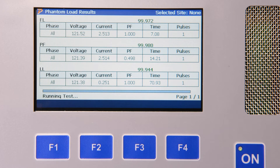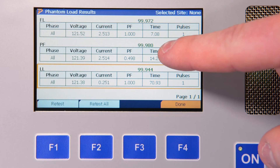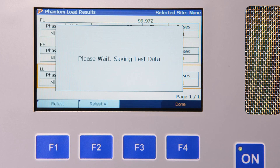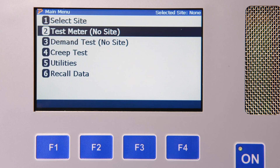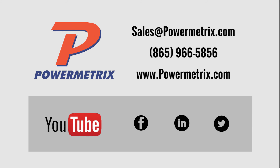You can see that for this test, the meter was well within its accuracy specification on full load, power factor, and light load test points. So we can simply hit F4 to stop the test. The test data has now been saved in the database and can be easily shared throughout the utility. In just a few minutes, you have completed the ANSI meter test. If you have any questions about this demonstration, please let us know. Thank you for your time, and as always, be safe out there when you're testing.